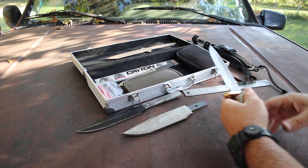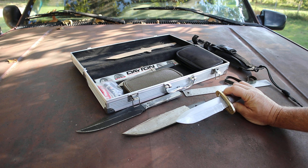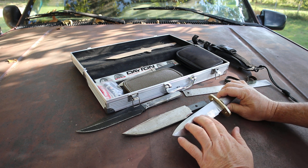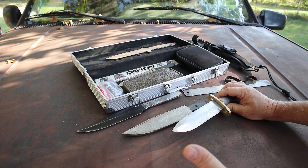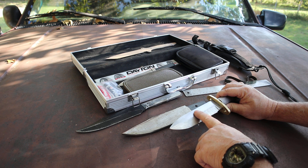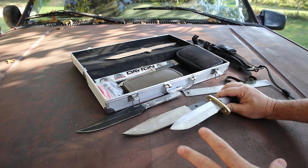I've got a lot more polishing to do on this by hand — I need to get to the finer grit to shine it up. When you're looking at a shiny blade, you've got to have that nice fit and finish. That's one reason I love 5160: it has 1% chromium, it's a high carbon steel with 0.60% carbon. I'm also going to get some 52100, which is basically like 1095 with 1% chromium. The difference between 52100 and 5160 is that 5160 has 0.60% carbon content.